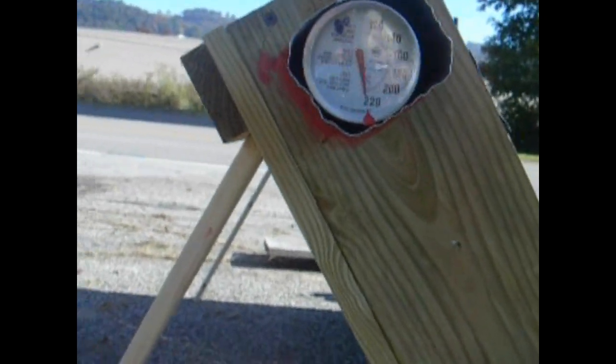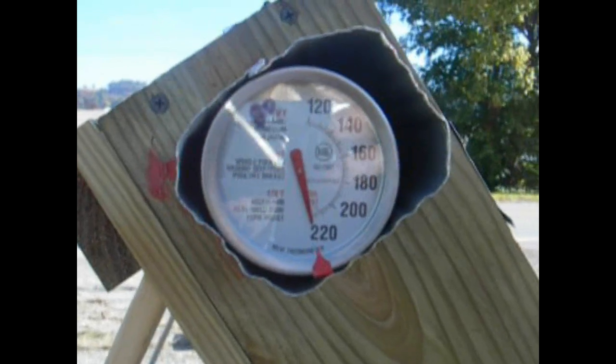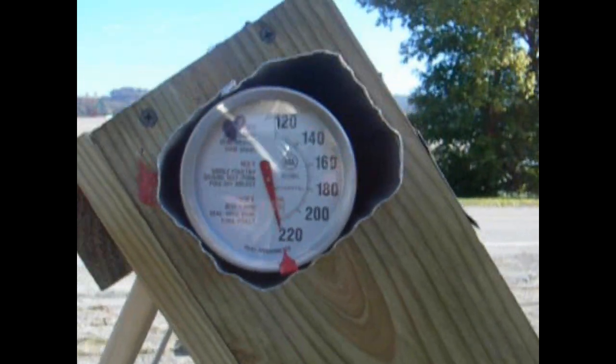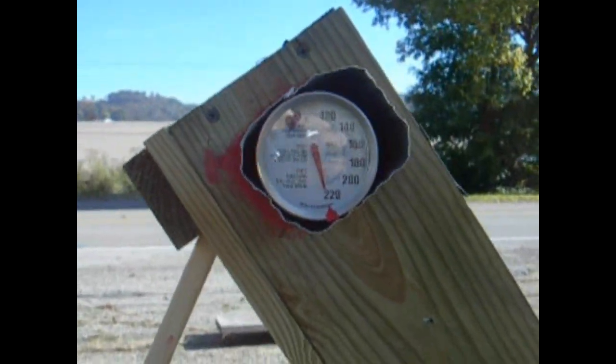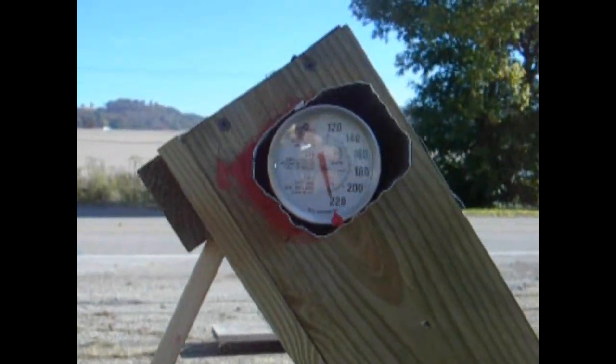It's been about an hour and 15 minutes — 220 degrees! I didn't think I'd get this hot. This is very cool. And I didn't cut out the top of the can, just put a hole in the bottom on the middle one. So you don't have to do all that. Good test. It's still at 220. After I take this home and mount it, I'll do an update video. I don't think I'll get that kind of heat because I'm in full sun here and I've got trees to filter. But anyway, that's proof there's a lot of stuff you don't have to do with these short columns. There's only 105 pop cans in there and I'm getting that kind of temp out of that with the downspout. That's the only way to go. Thanks for watching.